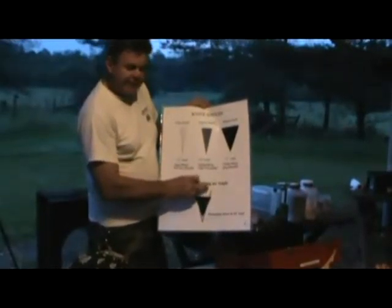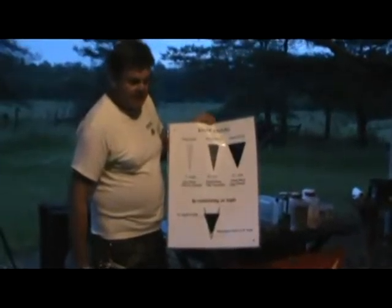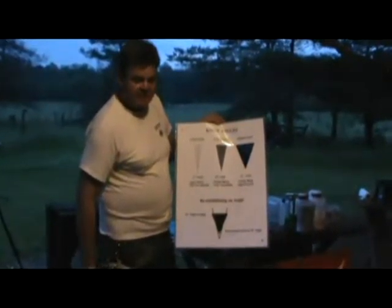The reason most knife sharpeners — you take it, pass your knife two, three, four times and it won't sharpen — is because the knife doesn't fit that specific angle. You have to grind off all this metal before your knife even fits in there to start sharpening. That's why, if you're going to buy a knife sharpener, get one you like and stick with that one. Only use that one on your knife so you don't have to keep playing around with this. The first time you sharpen a knife, you have to match your knife to the sharpener. It might take you 15-20 minutes to do that. After that, it should take you less than a minute.